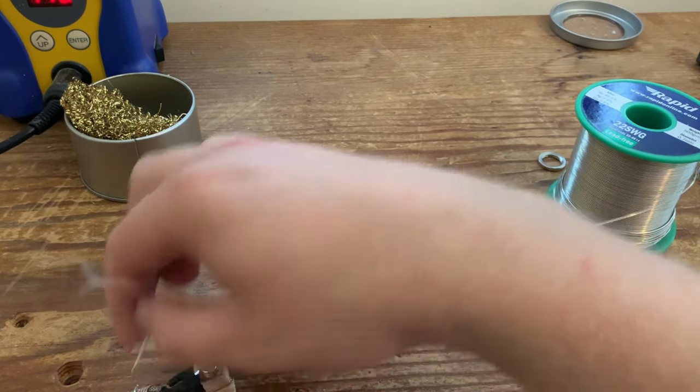Now, using the tinned copper, we're just going to have a continuous ground wire connecting the four pots together, exactly as we do in the Les Paul wiring video. So take your tinned copper, and again, it's always a good idea to use some tape. Got some Gorilla tape here, duct tape, just to tape the wire in place to stop it moving around.